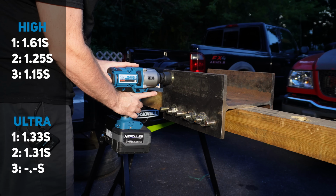The other thing I just want to take a quick look at is the hammer mechanisms. This is the hammer and spring and planetary gear mechanism for the High Torque, which comes in at 33.1 ounces, and the Ultra Torque comes in at 36.4 ounces, and it's actually a little bit wider, just a hair. So the hammer mechanism here and the spring and the planetary gears, that assembly is about 3 and change ounces more than the High Torque version.